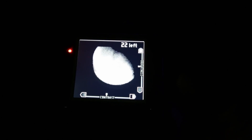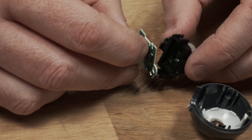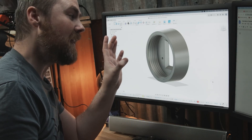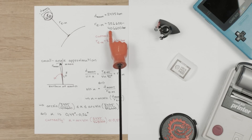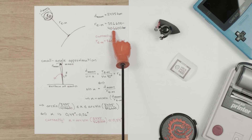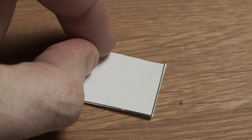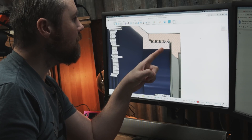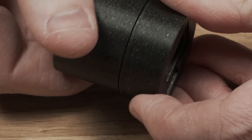And it could capture images at an outrageous resolution of 128 by 128 pixels. It could only store 28 images directly onto the cartridge and only capture black and white images with only two shades of gray. To say it's pretty limiting is a fairly massive understatement. But it still caught the imagination of David at Hackmake Mod, and he's determined to capture a full frame image of the moon using this camera. He's scrapped the original optics, which included a wide angle lens, but kept the sensor and built a new housing out of 3D printed parts, which allowed him to mount a variety of different lenses. What's incredible is he shows all of his calculations for determining the field of view he'll need to fill a camera frame with an image of the moon.